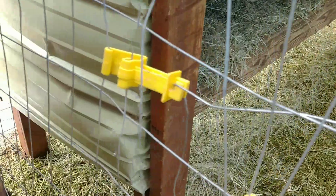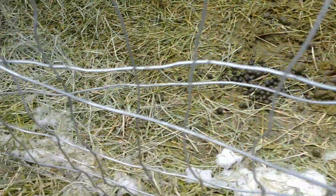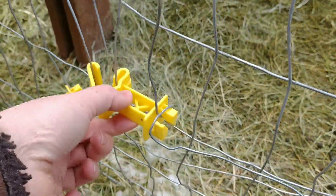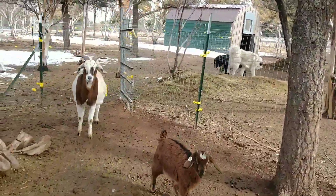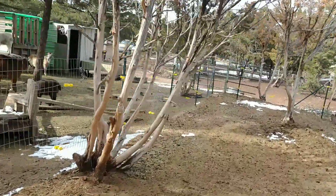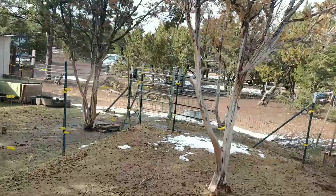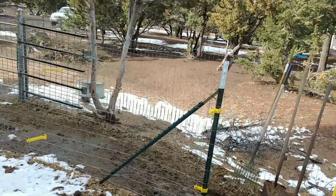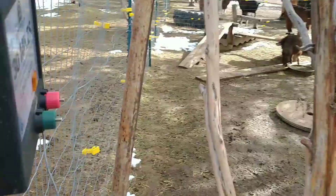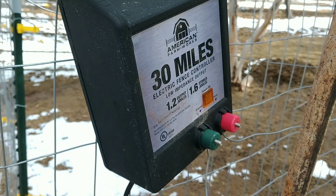So we're going to look at this wire. Not touching. All the way out there is not touching, so that wire looks good. Same with on the top on that far side. This wire on this side, we're going to look at it and make sure it's not touching. To me, it's touching right there. So we're just going to pull that out. Now it's not touching. We're going to go back to the box and listen. When we do the buck pen, I'll do a more detailed electric fence video on how to completely set it up from start to finish. But this is just how to figure out how your fence isn't working, or why it's not working. Here's our box - and now you can see it's not as loud. So that's where it was touching.